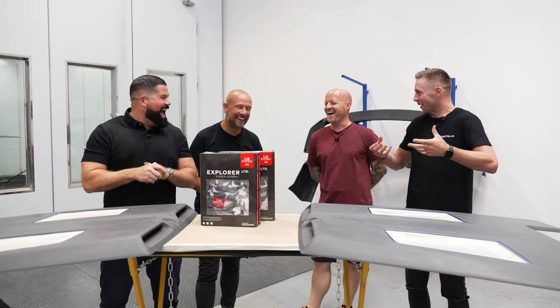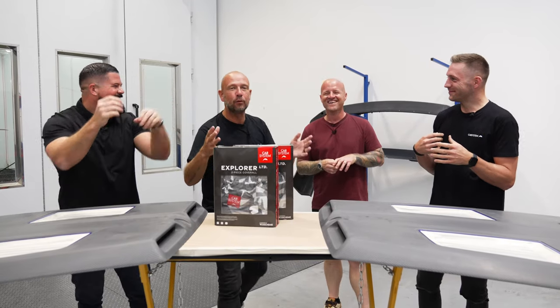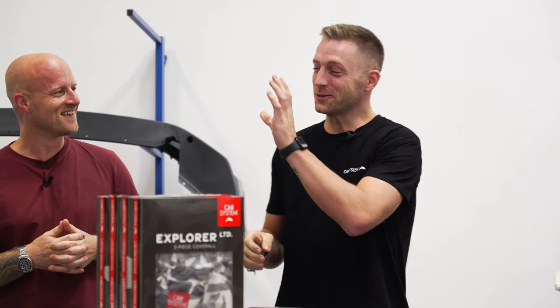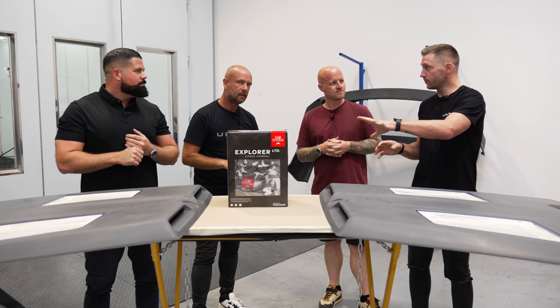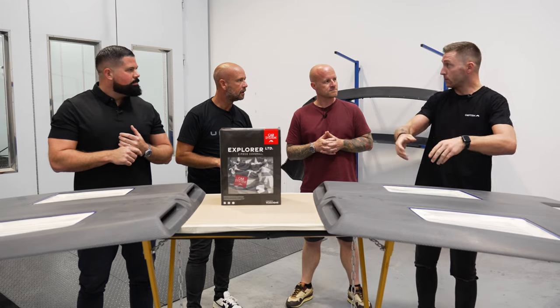Okay, so first of all what are we going to be dressed in is our new overalls. It's a two-piece overalls in camouflage optic — pretty nice to wear, pretty comfortable. When you stand the whole day in the spray booth you're sweating and stuff. This is a two-piece so you can remove the jacket; you're not carrying all the dust in the spray booth, so this is quite cool. Mainly we will focus on lacquering, so we will use our five-minute clear which is especially designed for carbon fiber, for transparent build-up.